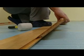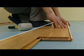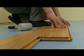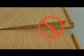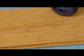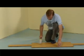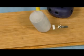7. For any installation, the starting row should be as straight as possible. Please don't continue if your first 2 rows are not straight or the panels are not locked in. 8. Do not tap one area consistently, no matter direct or reverse installation. Please always remember to tap the area 20 mm from the uphook joint area.